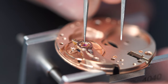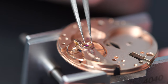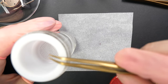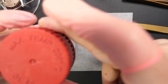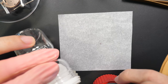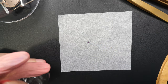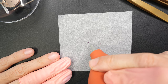Next we're going to oil the jewels from the balance assembly - a very important process because you want all the jewels fully lubricated to ensure good amplitude and accuracy. And the parts don't wear too quickly - that's why it's important to do a proper service on your watch once in a while. If you don't, not only will the accuracy suffer, but parts can get damaged from wear, which can be very expensive, and on old watches like this it's very difficult and expensive to find parts.